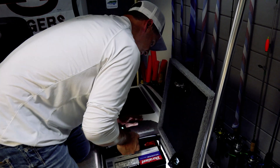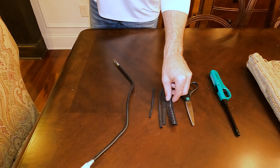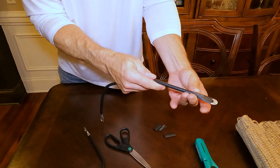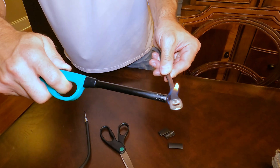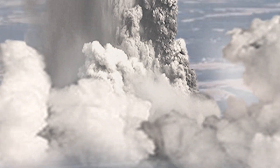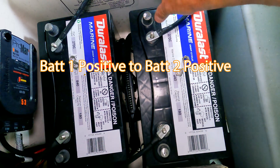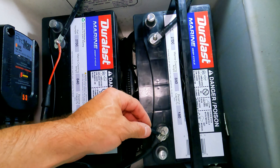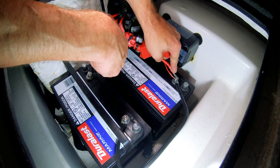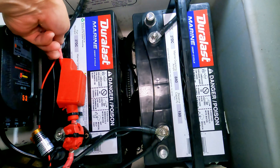At this point you can set your batteries in place in their new homes. Now you're ready to do the wiring. I just needed to put shrink tubing on my battery connectors. Because this requires an open flame, notice I didn't do this down in the compartment with my batteries, which is right next to the gas tank — better safe than sorry. Now make your connections as appropriate for your boat and setup, then connect your devices to the positive and negative terminals on opposite ends. Tighten the nuts to secure the wires.